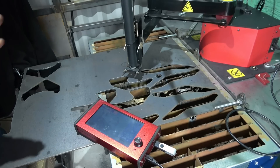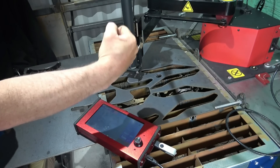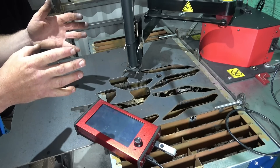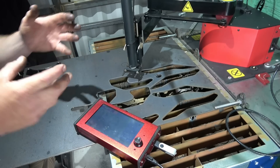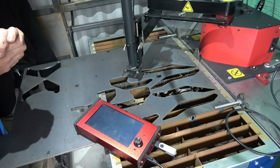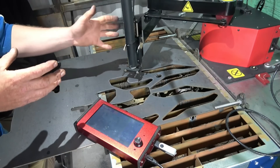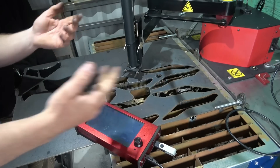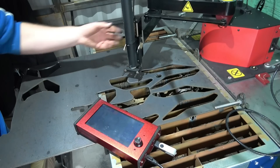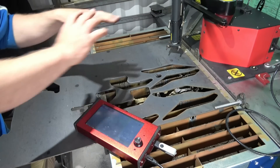The only thing I could suggest with this machine is, with it being a one-arm system, it can cut fast. But I would recommend going a little bit slower than your normal twin-wheel machine like the Xtreme Plasma, just so you can get a better cut on it. Because obviously if you go too fast, you're going to get a lot of wobble. But basically once that's cut out there, you can simply chuck the plate over and it'll be all cut out.